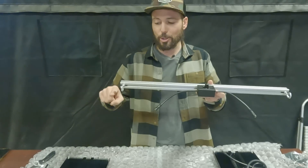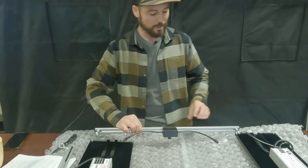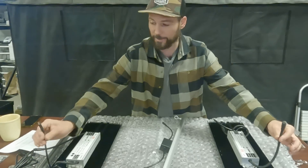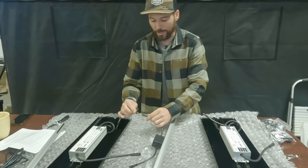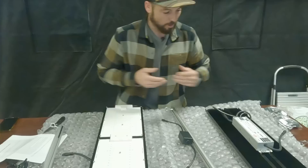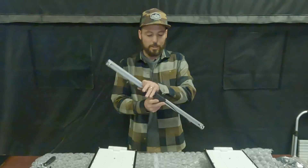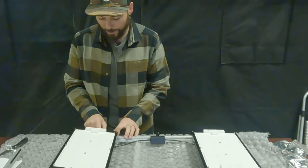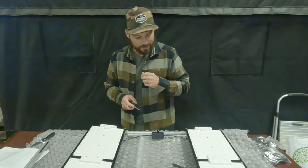The next thing is how this is oriented. These hooks go in towards the base of the light so that when it's done, I hook the light here and can access the dimmer from below the light, not above it. So I'm going to flip these over and match them up — right now the dimmers are on opposite sides, which isn't proper. I want the dimmer on the same side, so now everything's oriented properly with the dimmers on this side. I'm going to take my Allen wrench — this is 3/16ths, though depending on the light it might be slightly different, so read your instructions.